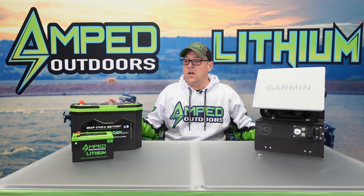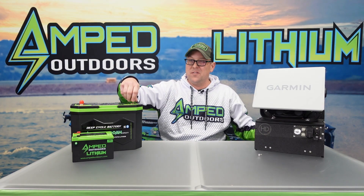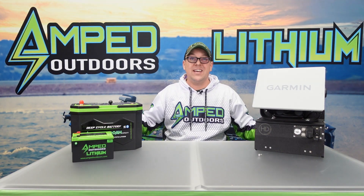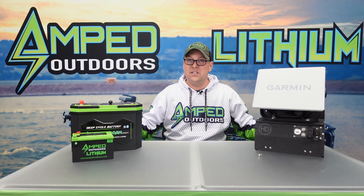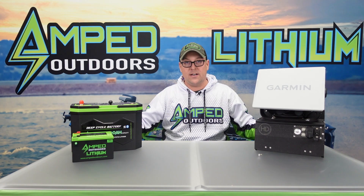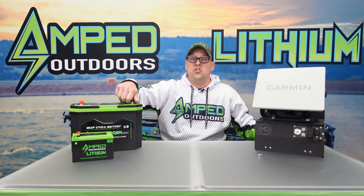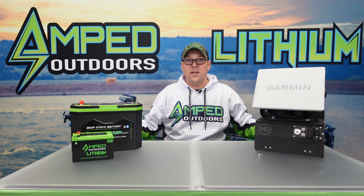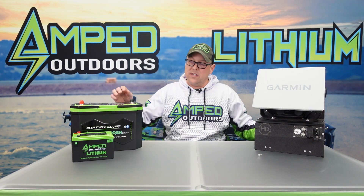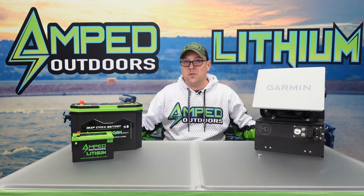When looking at your boat batteries, a lot of times people want to store these in their boat. A simple thing — get your tools, take five minutes, and disconnect at least one of your terminals and all the connections. If nothing is connected to that battery, it cannot draw it down. In storage, that battery is going to be good to go for one month, six months, or even longer during the off season. Check it periodically, throw a charge on it if needed, and when you go to put that battery back on in spring or fall, charge it up fully and it will work as good as the day you put it in storage.